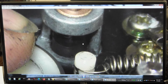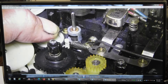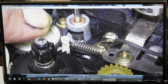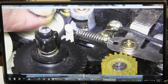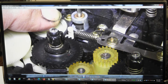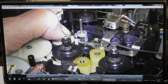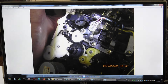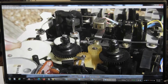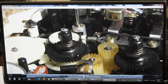Here we put in the new rubber. Here's another good view of the new rubber installed. We had to clean the underside of this gear, we cleaned this tire, and we had to clean the underside of the white gear — you can barely see it right there. That was very dirty as well. Just trying to get a good view of the cleanliness of this tire and idler tire on the capstan. It's very clean — I still couldn't get all the black off of there, but oh well.